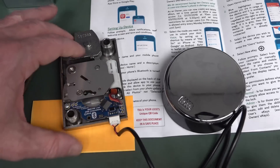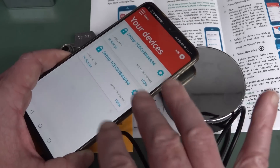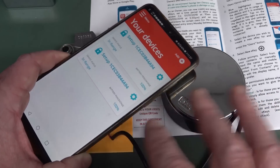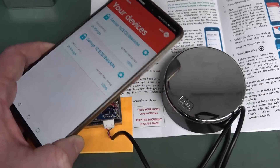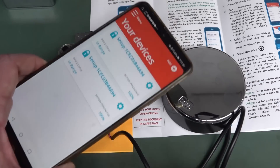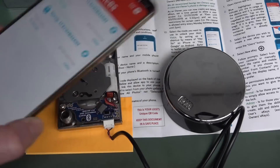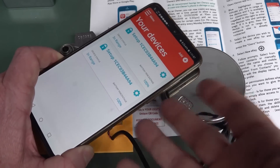When the master phone gives access to another user phone — a lower-level user phone that can get into this thing — they don't actually share any key. No key is kept in here or shared with the other device. Basically it gives permission for the other device to then negotiate with the micro in here to actually set up pairing and key in. In theory, it did confirm that you could install some custom-written firmware — spyware — that could get onto the phone and potentially access the thing, but you have to physically be there and physically have that device.